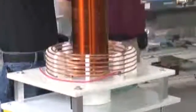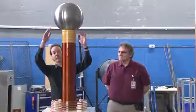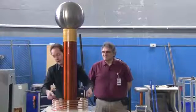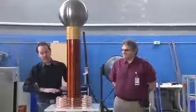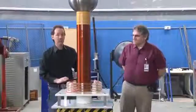And that protects you. If you have a coil that's prone to getting primary strikes, usually because your field shaping is poor, it's going to try to hit the primary. You just put a primary arc ring out here and it'll hit that and just dump it out safe. So that's a thing that may happen with this coil. It all depends. So with that, you want to give it a shot? Sure thing. Let's do some stuff.